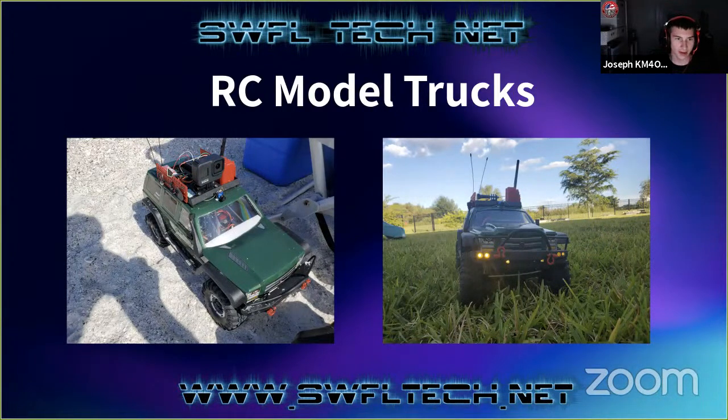So on here, I've got a long range module, which is actually an upgrade from what this truck comes with. These come with 2.4 gigahertz systems, and the remote controls don't put out very much power. You can get about maybe half a mile if you're lucky with these. Even that's a bit of a stretch. Quarter of a mile on land. There's a big difference when you go up in the air, but on land you get about a quarter of a mile at the most. With the long range system, you can get about a mile out of it with the setup I have, but I am working on a better setup.